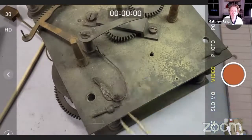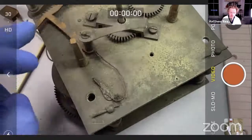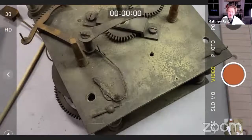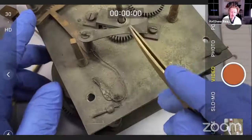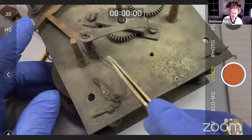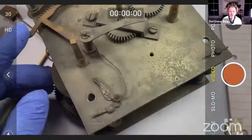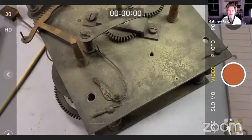rack spring here. So the thing about replacement rack springs, and sorry to labour the point, but from a clock repair perspective, if anything's important, is they're often replaced far too strong. And the problem with that is when the rack drops, particularly in the long hours, 10, 11, 12, whatever, the pin on the rack arm hits on the snail with such vigour that it breaks a rivet here eventually. You often see this rivet has been redone, and then you're into a whole new set of problems.